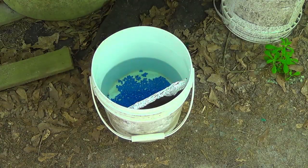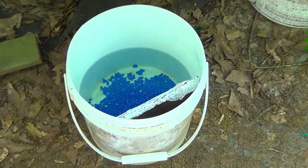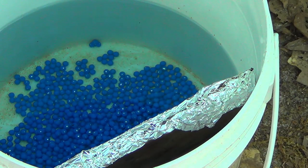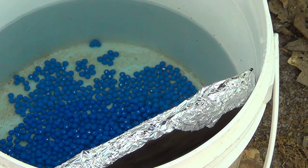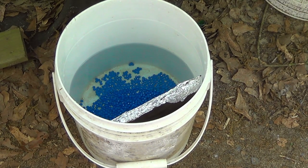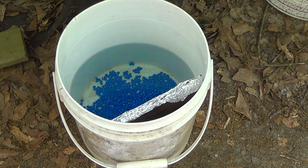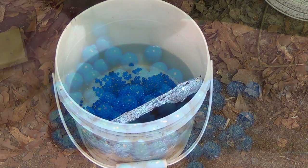It looks like we were just before. Some of the pellets were just before starting to melt. So we were right at that point. We all can see it. Let me see if I can get y'all zoomed up. You see them little shiny spots? That means some of the lead was starting to liquefy where it was contacting the bottom of the pan. So, in a perfect world, probably 7 minutes would have been about the perfect number, not 8 on this one right here. No damage done, but it could have been a mess.